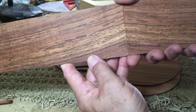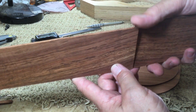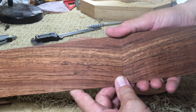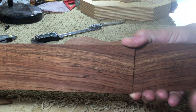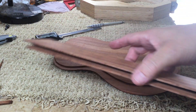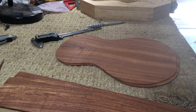Same thing with the sides — you've got to remember which is the book match on the inside. The book match will determine your end-grain edges right there, and you want to maintain the nicest match. Sand down the opposite side. You can see right here — this is probably going to be the outside of the book match, which is going to be the inside of the instrument. If I flip it over, you can see nice grain going all the way through matching a little better. So this is the inside of the book match. As soon as the sandy marks are off of this one, I'll start thicknessing from the back side. These are almost right at thickness anyway, so probably not going to do a whole lot more. We're going to move to the thickness sander — you can fast forward through at this point — and then we'll come back at the end and talk story.